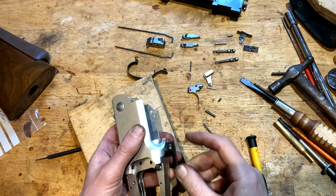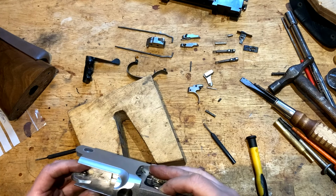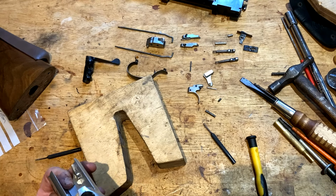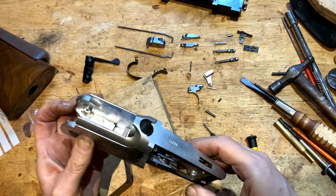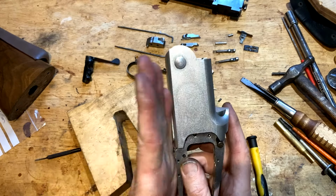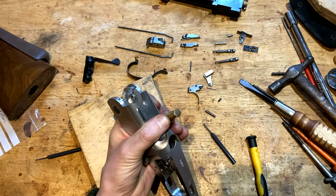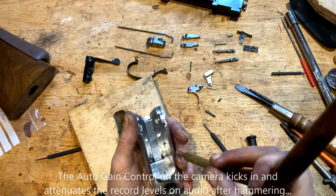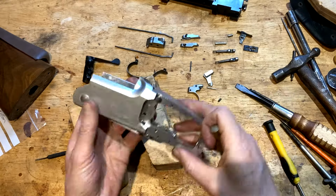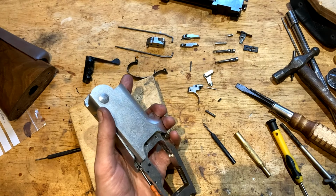So as you can see, that's freeing up now. Nothing to hold that in. There's not enough room for the bolt to drop out yet, so gotta continue. There's a tang there holding it in place, so that's why it's coming out like that. But because it's an aluminium alloy, you cannot just wail on it too much because it will mark it up. Just can't keep wailing on it, because unlike steel, it will likely mar. There you go, it's coming through. Very gently. There you go, it's free.